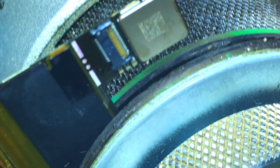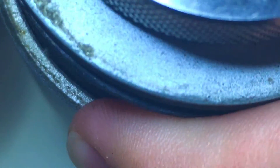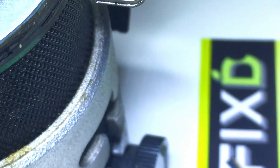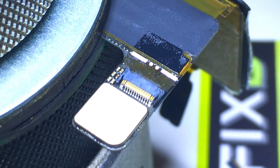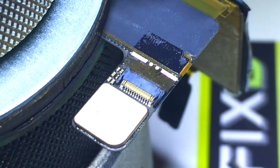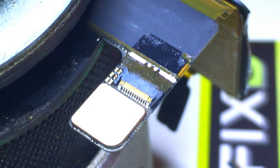I'm trying to get the camera to focus here — a little tricky — but you can see the sheen. For those of you who solder, that's normally enough to see that those are good joints. Then I'll take it out of the clamp and use a little bit of alcohol just to make sure I release it without cracking the thin board attached to that ribbon cable.